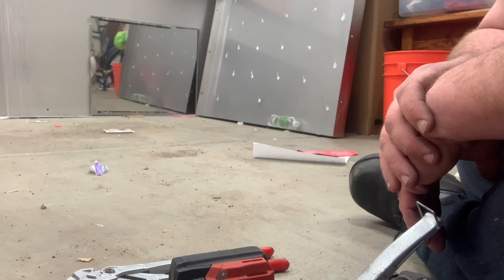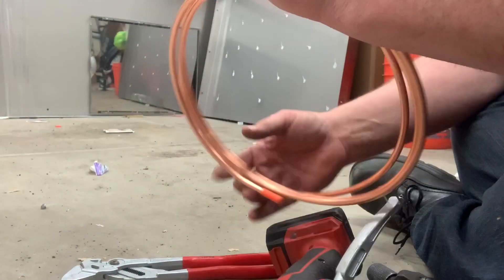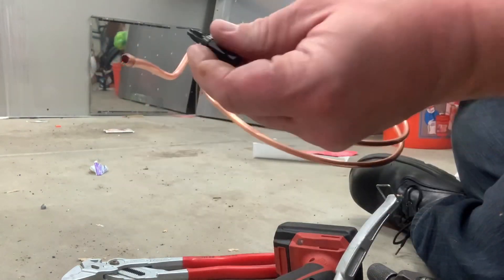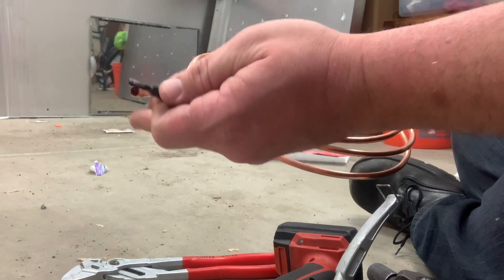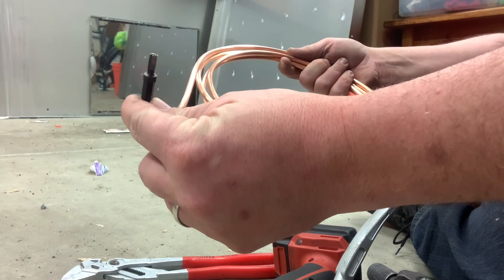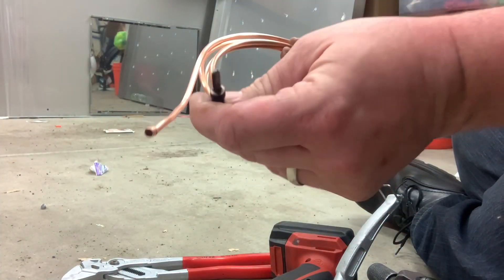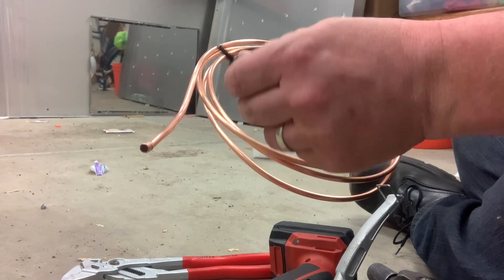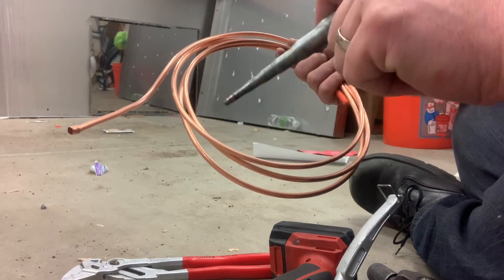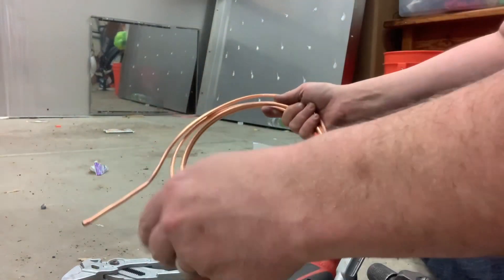I should mention this is pretty thin-walled tubing — the thicker wall stuff gets harder to swedge but is also a little less likely to crack. With the spin bit, the heat it generates means you've got to be careful not to burn yourself, but I've found these are not very prone to cracking tubing. Whenever I do training I make a bunch of little chunks and have the person braze them together. I always end up using the spin bit when I'm swedging out 15 or 20 little connectors — I've yet to crack one. It's hard to crack one with a chisel too, but it's possible, and it's easy for it to go sideways in the clamp or do weird things if it gets away from you. Anyway, let me know what you guys use.